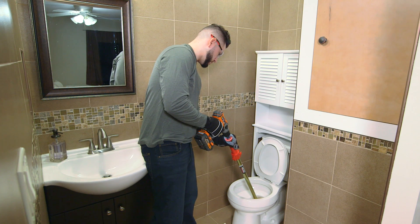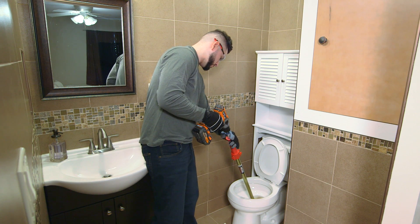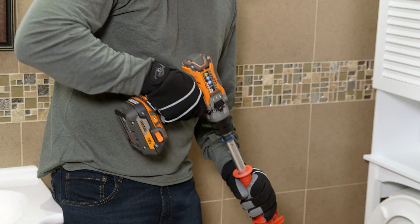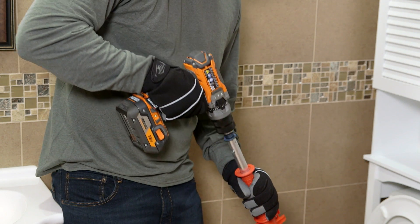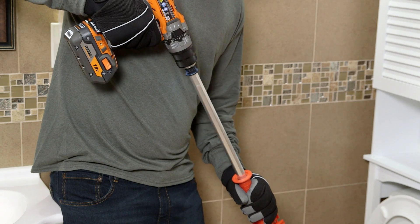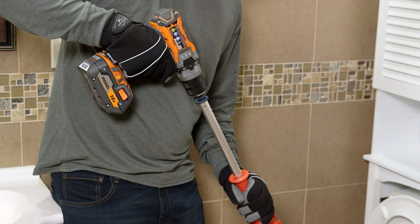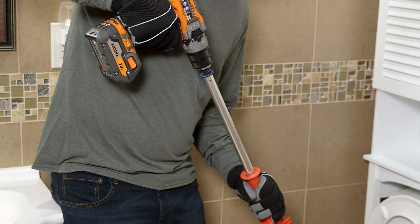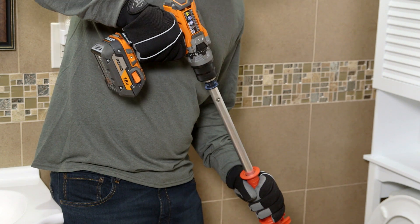Start the drill and advance the cable in the forward direction while pushing the drill toward the guide. This sends the cable down into the toilet to a maximum of 3 feet. To negotiate traps and other tight bends, use sharp thrusts of the cable in and out, both with and without the cable rotating. Continue until you encounter resistance. If the cable becomes stuck in the blockage, stop turning it and back it out of the blockage.